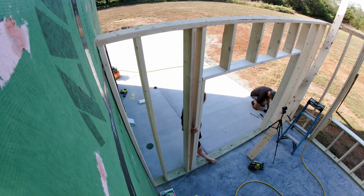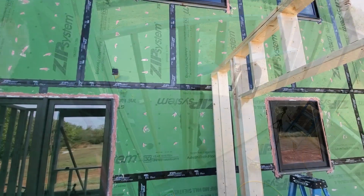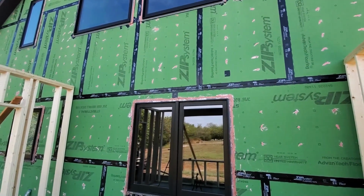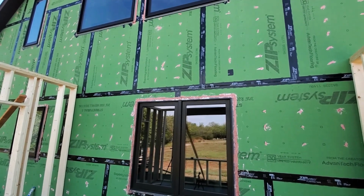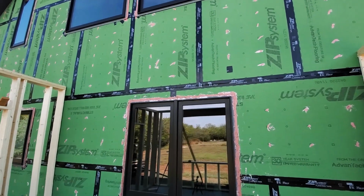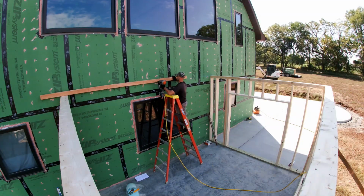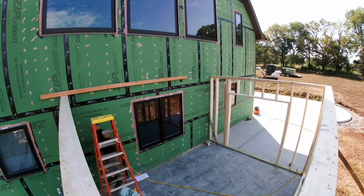Well, I got all the walls up now. The only issue is attaching them to the house, because you can see where those pink dots are. Those are where my studs are. So clearly there's no stud to attach the wall directly to. So my plan is I'm gonna run a 2x4 along the top of the wall, nail into all the studs and attach the wall to that, because I'll need to have a nailer here anyways for drywall. And then when I build the trusses along this side, I'll have to take into account that there's an inch and a half less on the bottom.